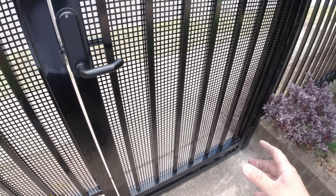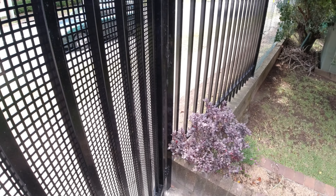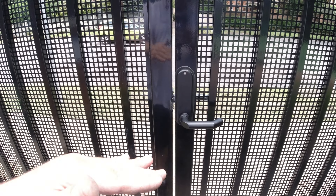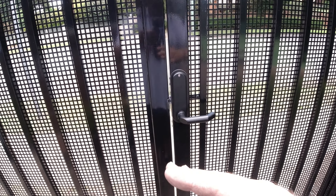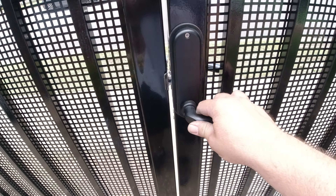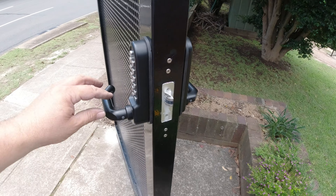I would not normally fit a lock like this on a gate, because this gate will eventually move. It'll move — there's only about five mil up and down, five mil this way, five mil that way. Whether it's the hinges, the gate bending, or kids riding on it, they always move. So I like to give it a little bit more adjustment, which I have on this one, and it should be working well.